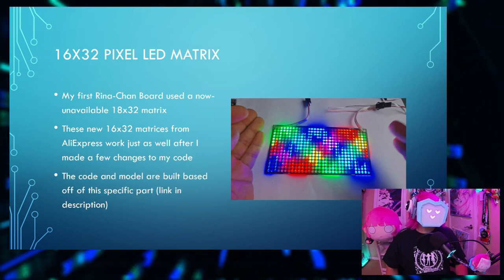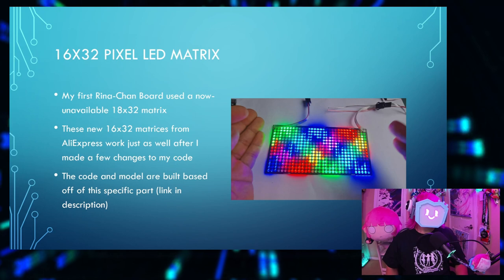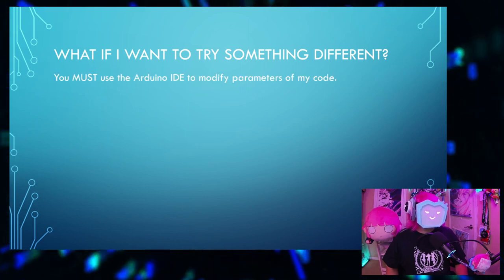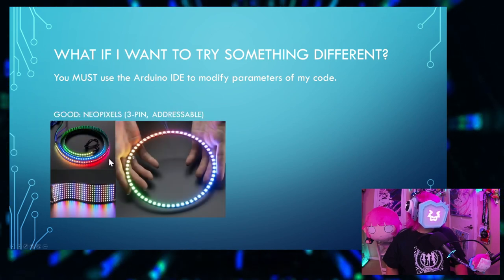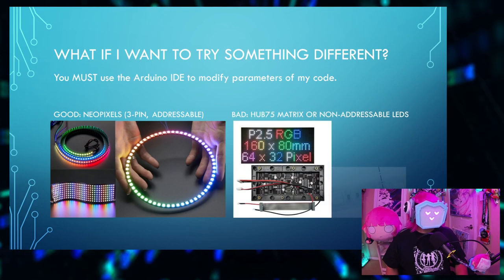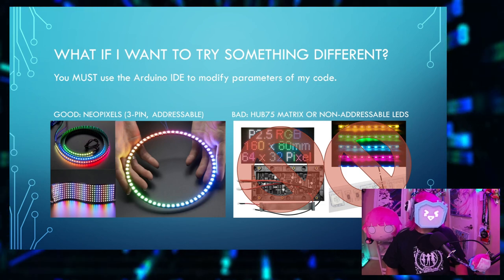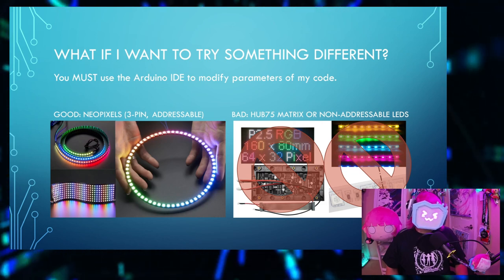Be aware that the code and model are both built based around this specific part, so I'll put a link in the description. But what if you want to try something different? You know, use something that you already have. Then you must use the Arduino IDE to modify parameters of my code to fit whatever you used. You'll want to make sure that you're using NeoPixels. Those are 3-pin LEDs, and they are addressable. You'll want to avoid the more advanced Hub 75 matrices, which have like a whole big ribbon cable and they're really thick. And you'll also want to avoid non-addressable LEDs, which are typically like 4 pins.